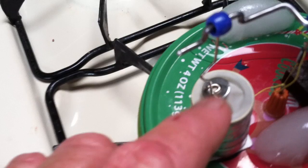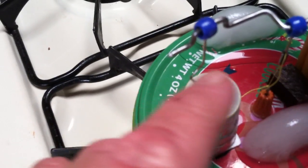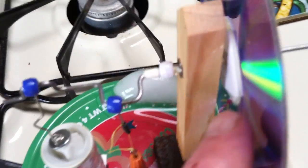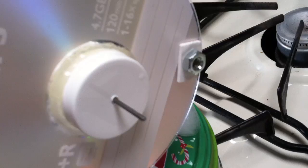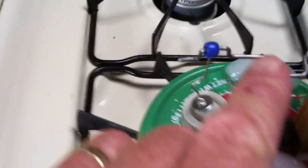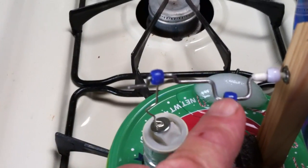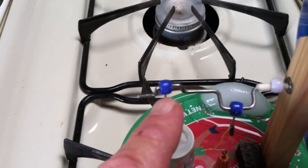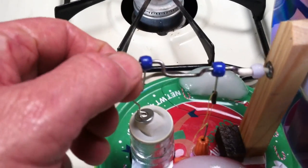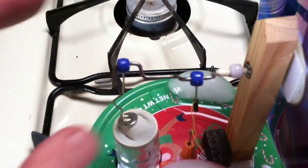I put a magnet inside and then a washer on the outside, then a dog leg kind of connecting rod. This is a coat hanger and there's some ball bearings in there — they're not sophisticated, just remote control RC model car bearings. The flywheel is just a CD with a nut for the counterbalance. But you've got to have these throws real short, so if you build one of these, make these as small as you can so it doesn't throw too far.